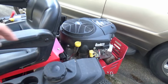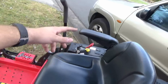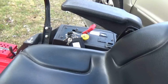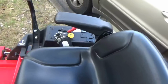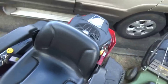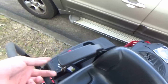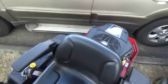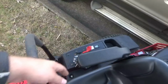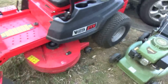Yeah, 15.1. Basically, because the guy who sold it to me accidentally left the key on, the ignition powered hour meter ran the battery flat over like 2 days, and it racked it from like 28 hours to 69.5. So what I'm doing is building up the difference on this hour meter, so I know when it's actually reached 69.5, and I'll take that hour meter off and do something with it, then reconnect this one. It's just a little cable under here. This has been a good workhorse.